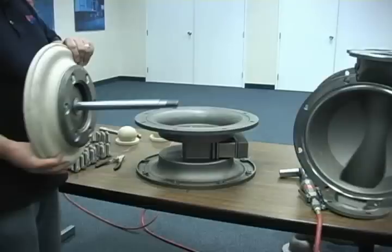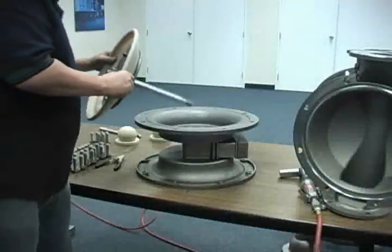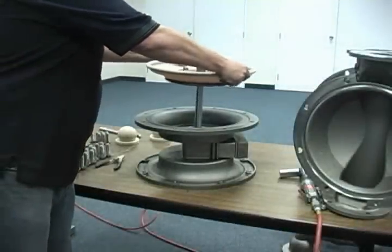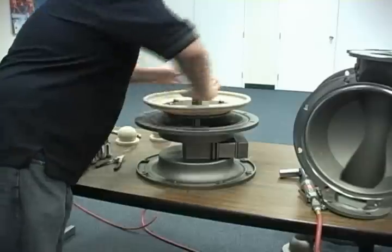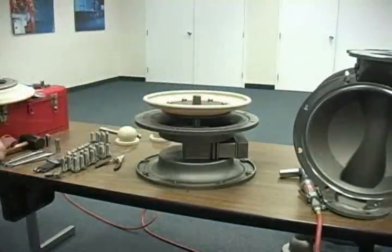Next, build a shaft, piston, and diaphragm assembly. The shouldered washer must be installed with the shouldered side towards the center block and the flat side towards the outer piston. Lightly coat the glide rings with lithium-based bearing grease. Using a twisting motion, gently install the main shaft into the bore. Do not force the shaft into the bore as the center block glide rings may be damaged.